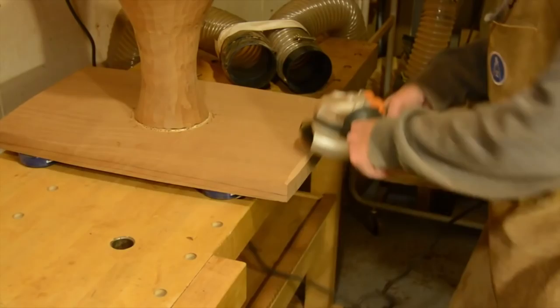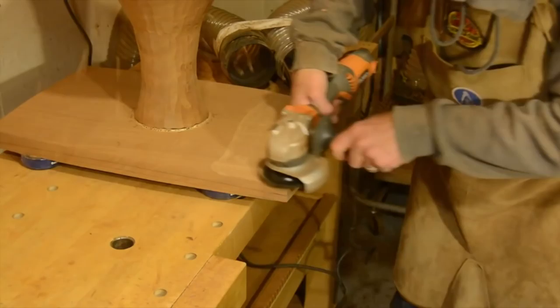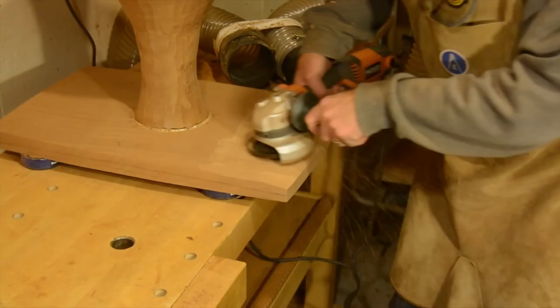I've then rotated the piece and follow the same principle of making a lot of small fine cuts, pivoting the tool against my body to maintain level control. With the overall shape of the base established, I move on to the bottom of the seat. I'm shaping the seat bottom to follow a gentle curved line that you can see drawn on the edges of the seat in pencil. Using the tool a little flatter rather than just focusing on the two to three o'clock position allows you to remove a good deal of material along a larger, flatter surface.